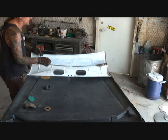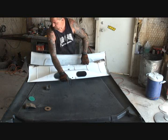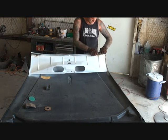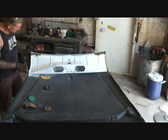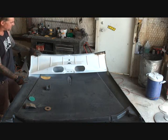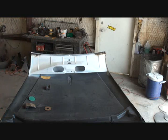So we take my piece like so — see if I can get started in there. You're going to see that that fits right up in there — that's going to be a very, very nice fit, a nice tight fit. What I got to do is go ahead and straighten all these edges just like I did on the roof piece. Then I'll clamp it all the way around and it'll be ready to weld in.